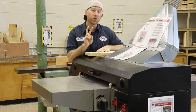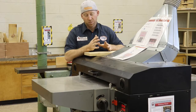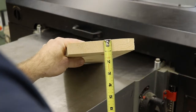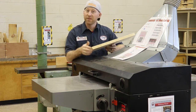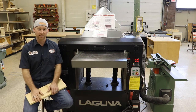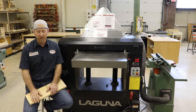The second thing we need to sort out is the most important part of this whole operation — the thickness. We actually need to sort out two thicknesses. We need to know our board's current thickness and we need to know our board's desired thickness. The desired thickness depends completely on what you're making, so check your plans to figure that out. To find your board's current thickness, simply measure the end of your board — that will usually vary from one edge to the other, so make sure you look for the thickest part. Around here, with our material after having gone through the jointer first, that's usually around one inch. We generally start planing at or just below our board's current thickness, so normally around an inch. Press 1 on the number pad and you'll see that the top window will display 1.000 — which is perfect, that's our target value.